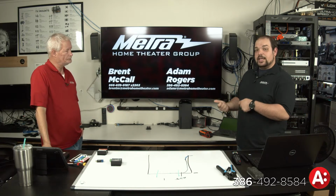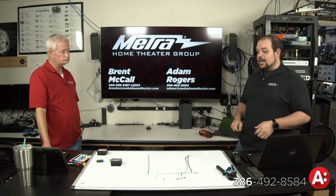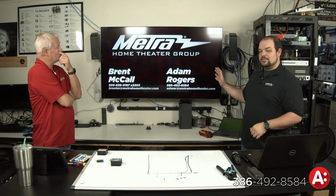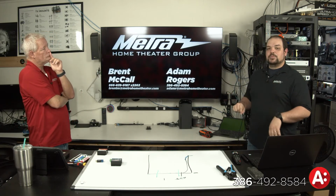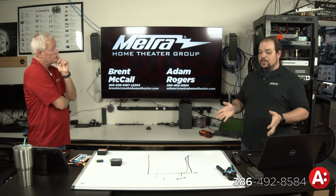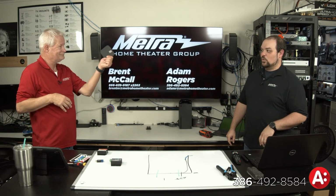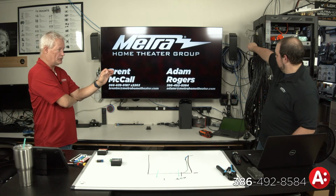Put the generator on all the other inputs, and go through each one. Leave the other input sources that you have, and move on from there. Same practice as testing what the TV inputs and outputs are, which of course, the output is the display. But the inputs, same thing. You want to test those directly there, with a known working device, with a known working cable.